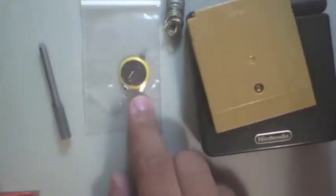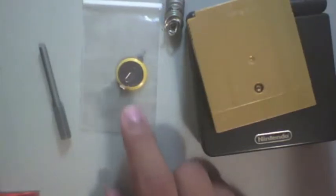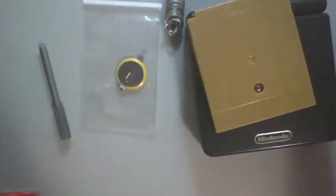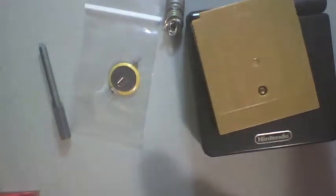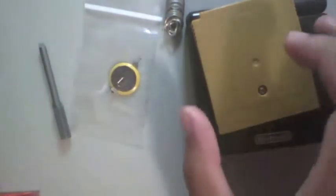I purposely got this battery from videogamemuseum.com, which I'll have a link to this specific product in the description, because it has these soldering tabs that I can solder onto. There is another way you can buy batteries without these solder tabs, and you can tape it in there, but the finished look is a lot better with soldering than it is with tape, because you need a lot of tape to keep it in there.